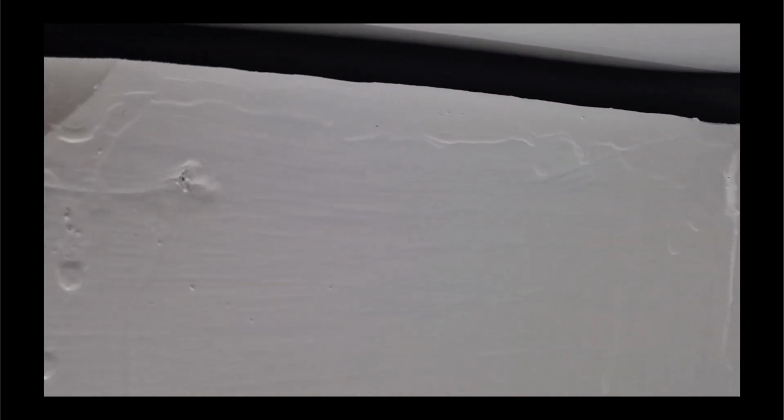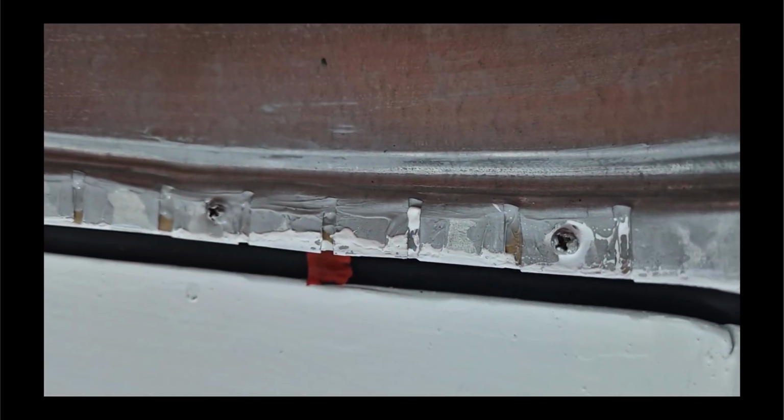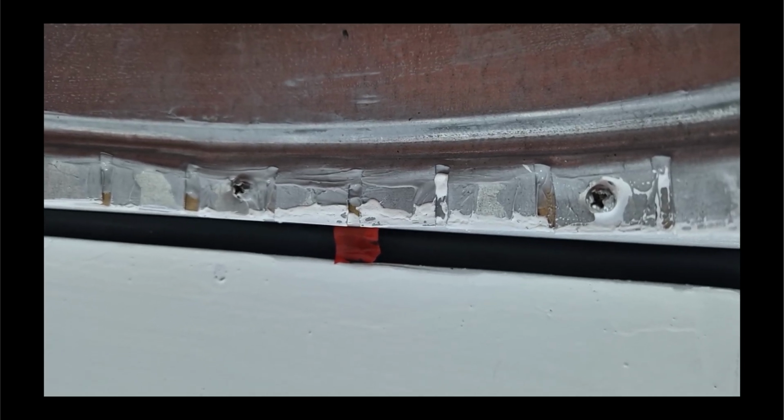And here's the gasket squeezed up. I've got approximately 5 mils in the concrete being higher than the polystyrene, plus I spaced the board up about 4mm off the concrete, which helps to keep water off the board if the water gets in there, and I think that's about the right amount of squash on the gasket.